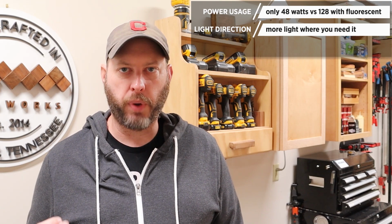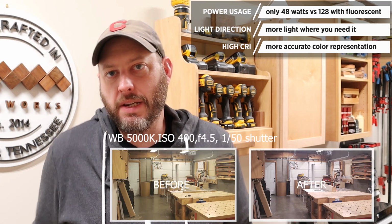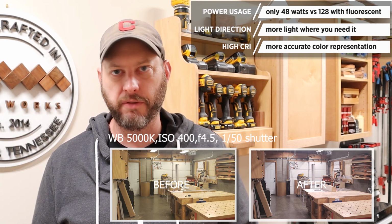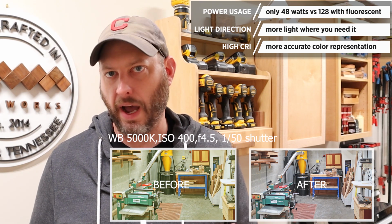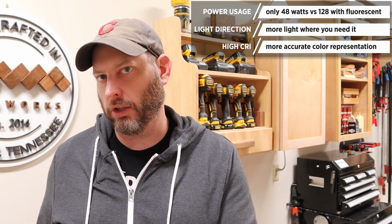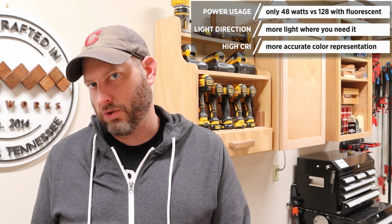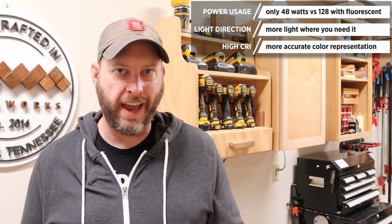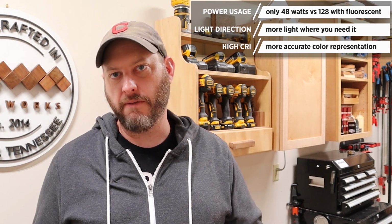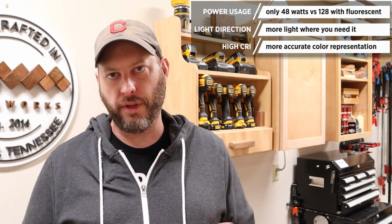The third, and what I would consider probably the biggest advantage to converting over to LED, is color accuracy. What that means is I'm getting better color representation, not only on what I show you guys on video and the quality of the video I'm able to produce, but also with what my own eyes see as I'm working in the shop. So if I'm trying to match wood tones, if I'm trying to mix stain colors, and get the color exactly to match something that I need it to match, I'm going to get the best representation of what that looks like under the lights that I've got in my shop now, versus when I had the fluorescent lights, which really can be heavy on the yellows and the greens and not necessarily give you the true color of the thing that you're working with.